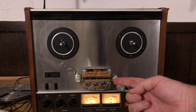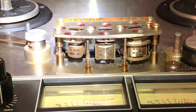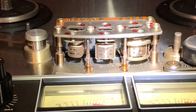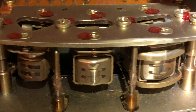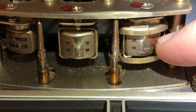With that, this thing should just come off. I'll flip it over and let you see the heads. I've got the headlamp on — trying not to blind you — just giving a visual of how disgusting that is. There's really some buildup here. From my understanding, this right here is the playback head, this is the record head, and this here is the erase head. The right side of that playback head looks really, really crusty.